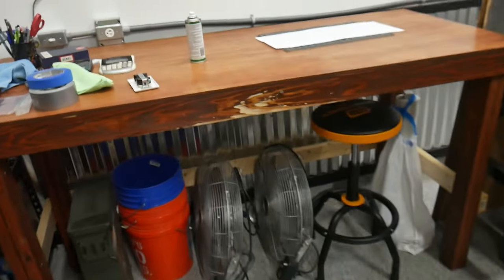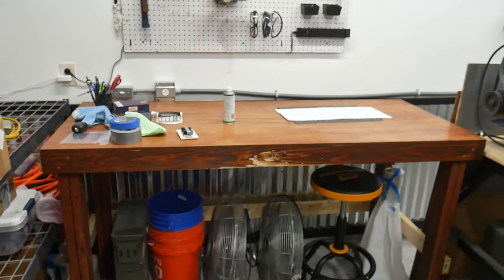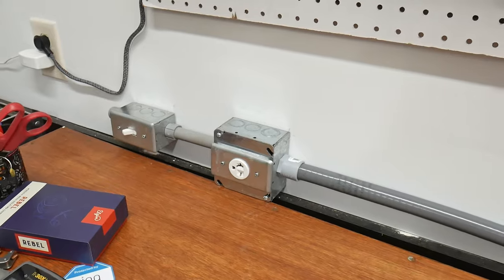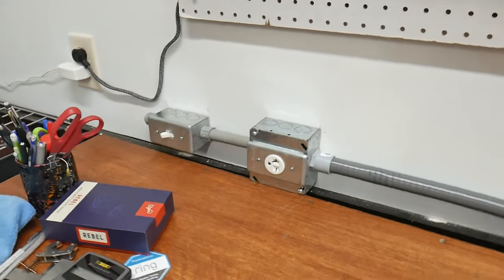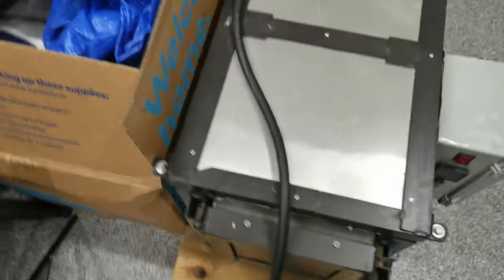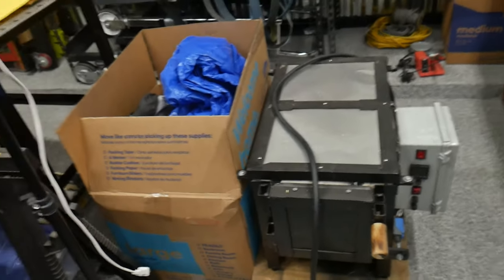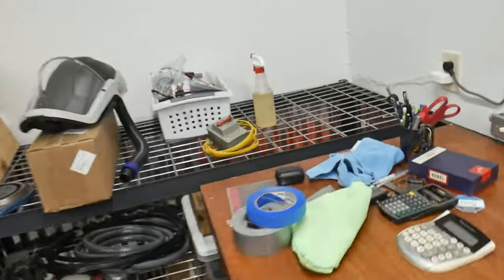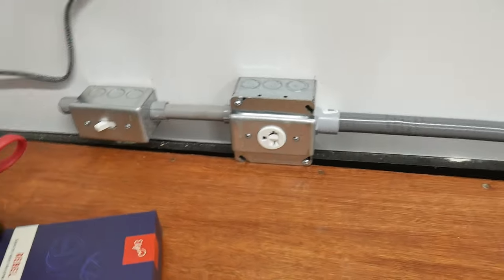We'll come around here — this is a wood bench I built quickly for the shop. It's kind of the main workstation right now, just plywood and 2x4s. This is the 20-amp 220 outlet I just wired in, which is going to run the heat treating oven. The heat treating oven is on the floor right here — the DIY unit capable of about 2,000 degrees Fahrenheit that we built a while back. The plan is to put it up on a plywood shelf and plug it into the outlet here, which has a switch so I can turn it on and off.